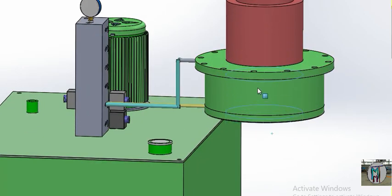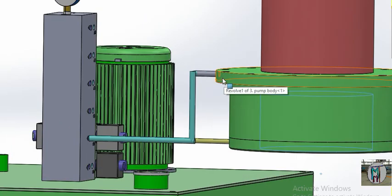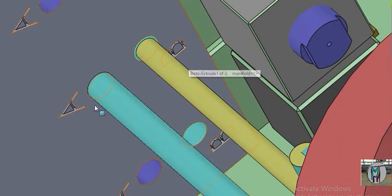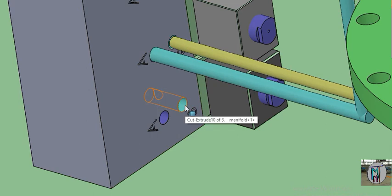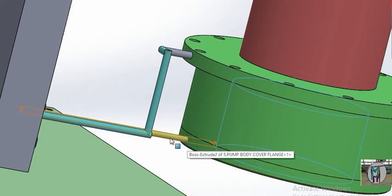Now we have fixed a cylinder here — you can see it moves upward and downward. We took this cylinder from our injection molding machine. In future videos, we will show the pneumatic and hydraulic functions and how they are controlled. This cylinder has two ports: A and B, marked with yellow and another color. We will plug the unused ports.